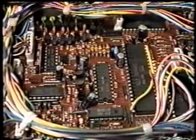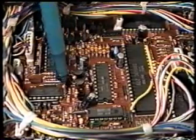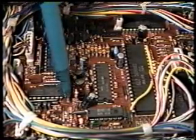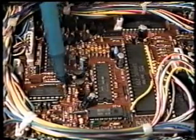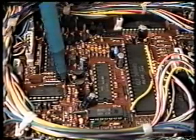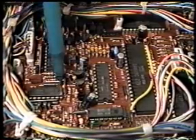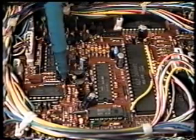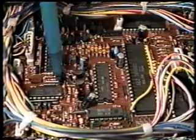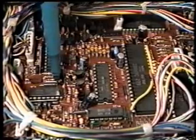All right, we're taking a little bit closer look, and you can see this is R202. This pin is directly on the top. That's R202 right here, and you can see it written on the board, R202. And the jumper is just to this side of it. You can see it right here. I'm moving it with my pen. You can see it's already been cut. And that's what we do. We cut that jumper. You see one side of it there. And that allows that 10 Hertz digit to be displayed.